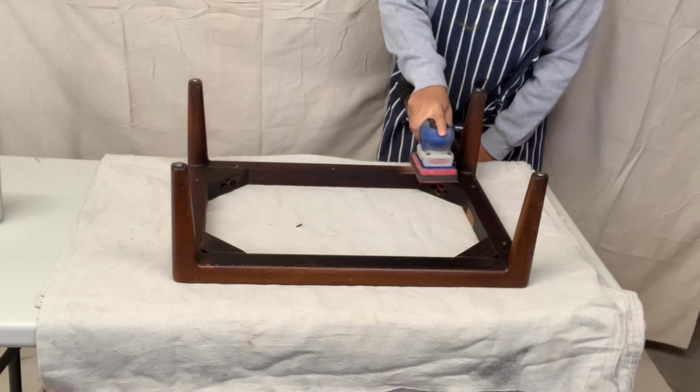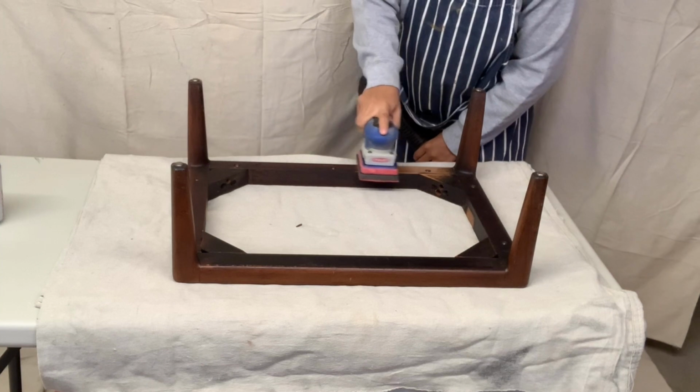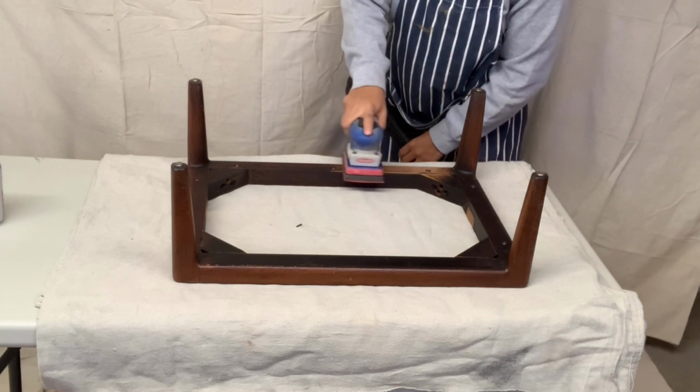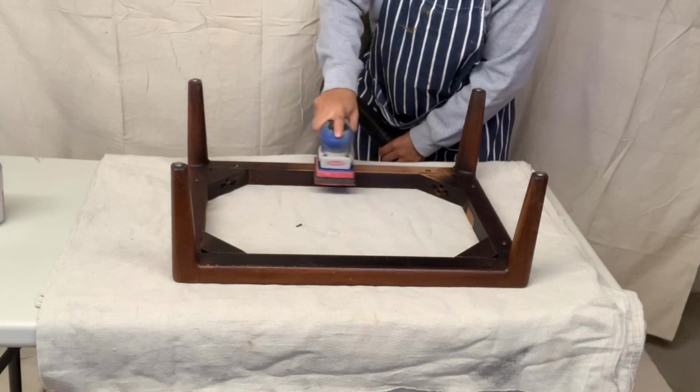As part of my design, I decided to restore the bases and top drawers for each piece, so I will be sanding them with my surf prep sander using 120 grit sandpaper and moving up to 220 to remove any pigtails left behind.